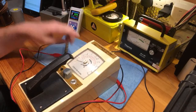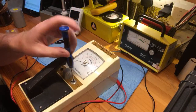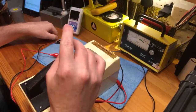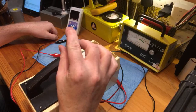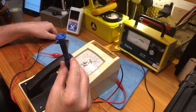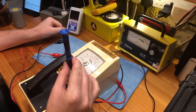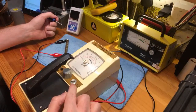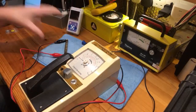If you don't want the needle to jump about as much, try adjusting the EHT setting to bring it down ever so slightly. If I start to raise it up, that's the power off the scale. So bring that back down again — go back to EHT, bring it back up to three. Be very careful when setting that. You don't want it too high and you don't want it too low for it to work properly.